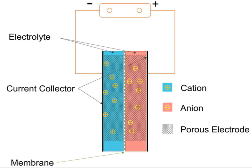Nevertheless, CNTs have higher capacitance than activated carbon electrodes, e.g., 102 F per gram for MWNTs and 180 F per gram for SWNTs. MWNTs have mesopores that allow for easy access of ions at the electrode-electrolyte interface. As the pore size approaches the size of the ion solvation shell, the solvent molecules are partially stripped, resulting in larger ionic packing density and increased Faradaic storage capability. However, the considerable volume change during repeated intercalation and depletion decreases their mechanical stability. To this end, research to increase surface area, mechanical strength, electrical conductivity and chemical stability is ongoing.